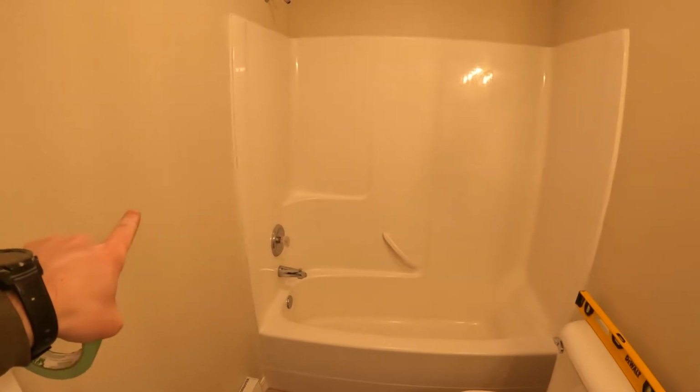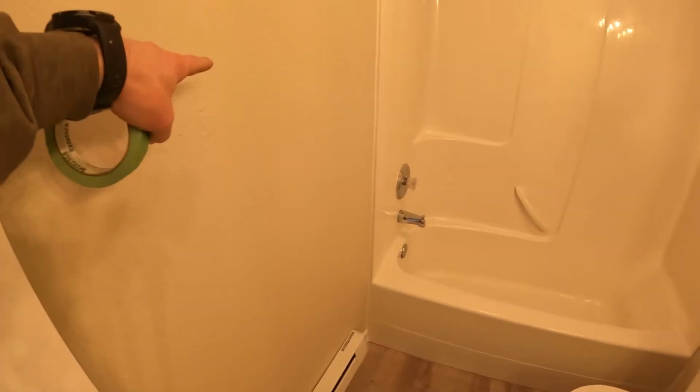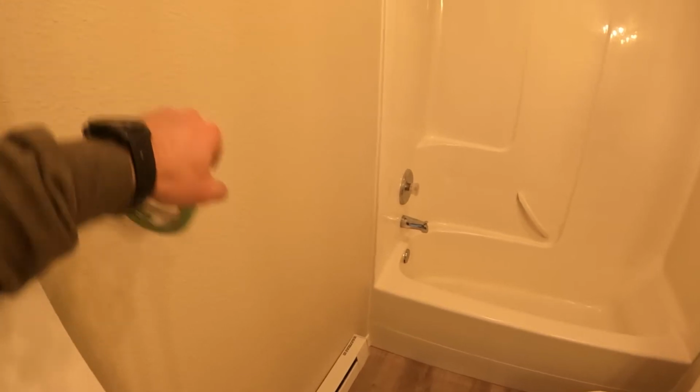They're by Kraus. I haven't used Kraus stuff that much before, but it's really good quality stuff. Looks nice, nice finish to it. So let's go ahead and get that put up on there. So we're going to be putting our towel racks right over here. There's a little base heater down there. So a client asked me to put it 50 inches above the base heater. In case they have long towels, you know, we don't want people's towels catching on fire.